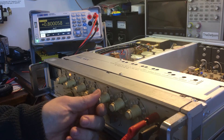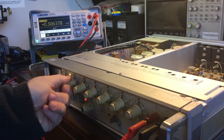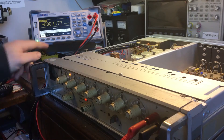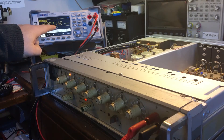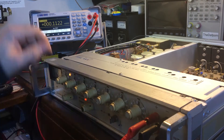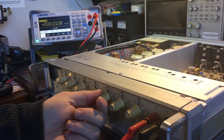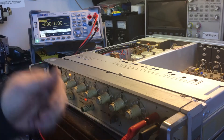That's not doing that. I've got 8 volts set — that's why. So 100 microvolts I've got set. Of course everything's still warming up, it's still very cold, so the values aren't exactly right. I've got like a 10 millivolt offset there.